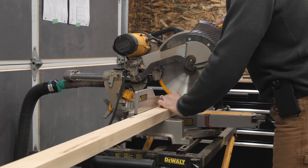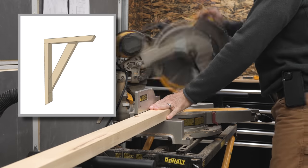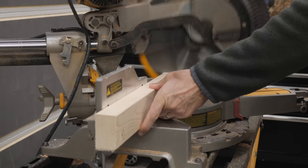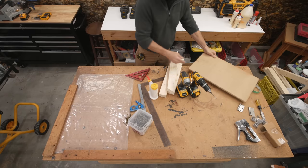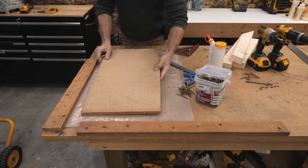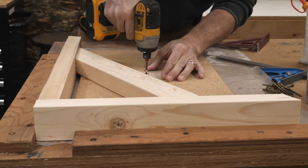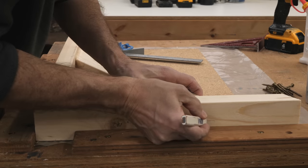I made a drawing of the shelves in SketchUp — you can download those two pages from manabouttools.com, link in the description. Starting with the three brackets for the lower shelf: the diagonal brace has a 30-degree angle on one end and a 60-degree on the other, and the first two pieces also have a 30-degree chamfer on the upper corner. On my bench I attach two strips of plywood at 90 degrees as stops to hold brace pieces at right angles during assembly. A half-inch piece of particle board lifts the brace piece so it's centered while lying on its side.